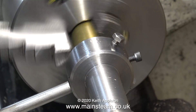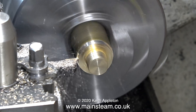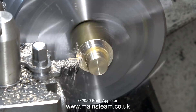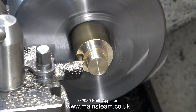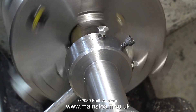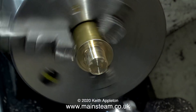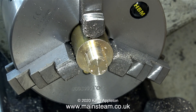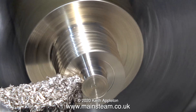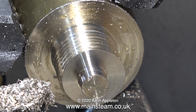The thread's okay, but I miscalculated — I could not get the die right up to the end. Before all the experts write in: yes, I am aware that if you turn the die around in the die holder it will cut more or less to the end of the travel. But I want to leave a little bit of parallel to take the o-ring, and the thread itself needs to be half an inch long. Also, at the moment I'm basically making a plug, which is no good for a valve adapter. After completing the turning, it's take two with the die holder. I'm withdrawing the die holder from the work. Some viewers may be asking why use such a big die — why not screw cut this part? The answer is simple: this lathe does not have a gearbox and I don't have enough change wheels to get the thread that I need. Early attempts at screw cutting were very unsuccessful — I often ended up with something that looked like a strand of DNA.